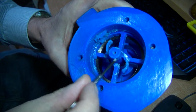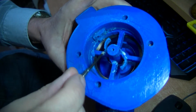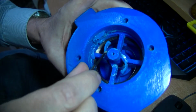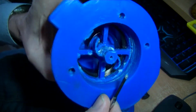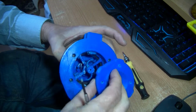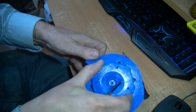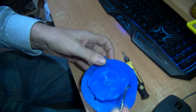This part here, the shaft ratchet, needs supports on. That might want 100% because of the arms. Everything's been printed at 30% here. The arms aren't too bad because they're so close together that there probably won't be any infill on that. Yep. Apart from maybe those couple of things, when you're putting this on, turn it and click it almost as if you're screwing it on, then pop the top on.